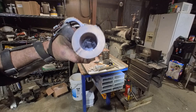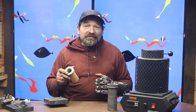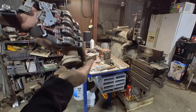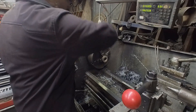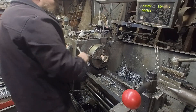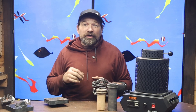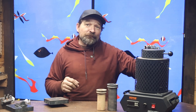Inevitably, after a couple of firings, you're likely to have a little bit of slag or dross that gets stuck to the bottom. As long as it's relatively thin, let it cool down to where you can safely handle it, and then using a piece of L-copper pipe, pick at it until you're able to get the majority of it out. When it gets to be too much for that, I gently chuck the crucible in my lathe, and with a boring bar, slowly whittle away at the stuck bits until you can peel the majority of them out. Lastly, do your best to avoid thermal shock — let your crucible cool down as slow as you can, and always place it back in the furnace to cool when you're done for the day. To summarize: slow on the way up, slow on the way down, only heat it up enough to get the job done, and leave as little as you can in the crucible when you're done.